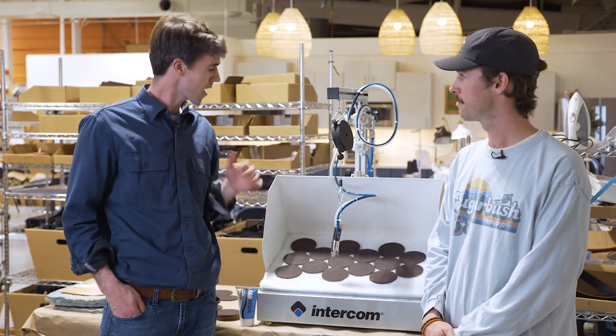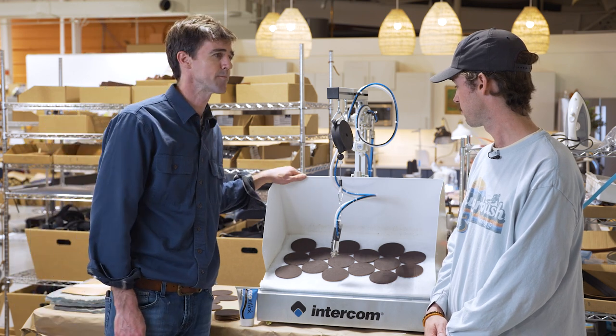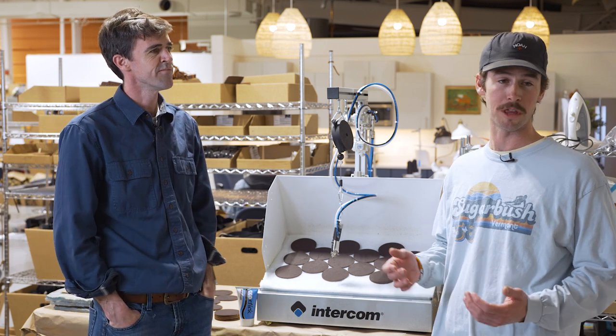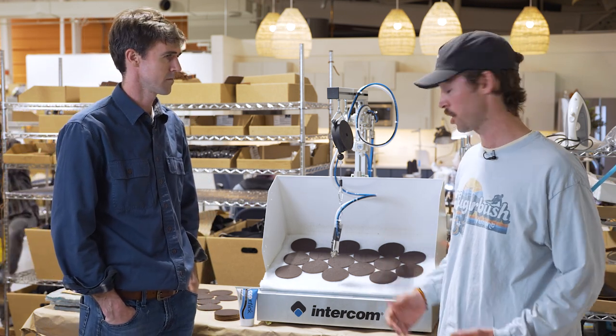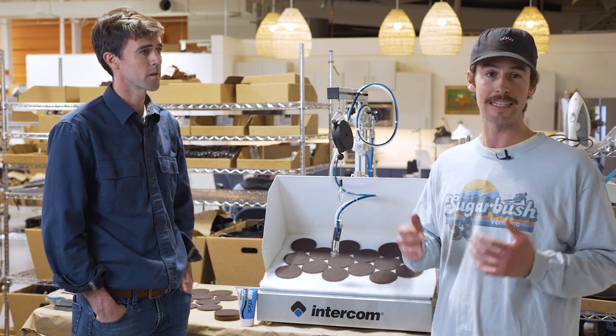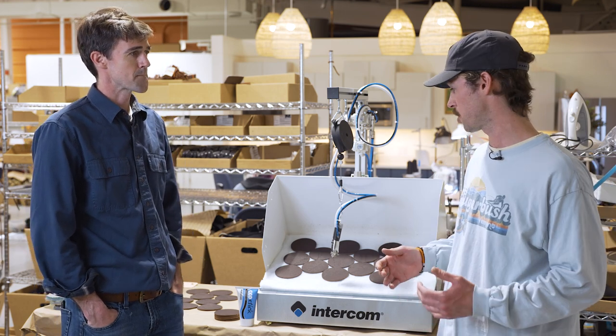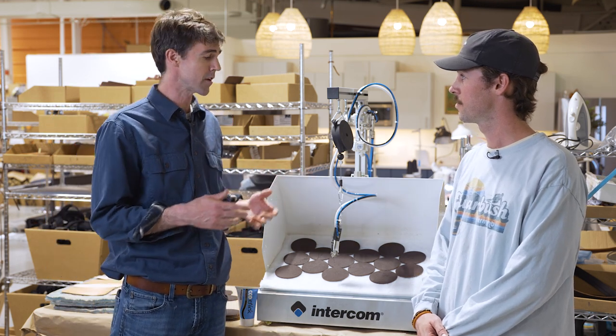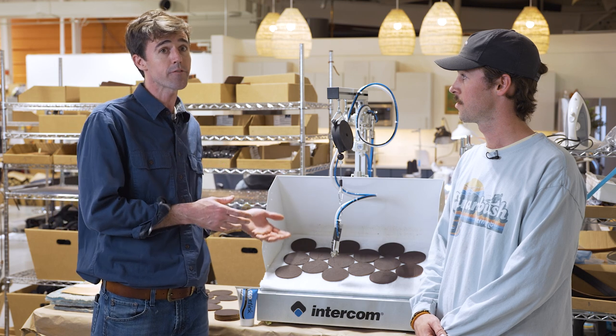We're down here with Ted, who runs our production facility for leather goods at Buckle Guy, to talk about how we use the I388 spray booth. Prior to using the spray booth, we were doing all glue application by hand with a brush. Switching over to this machine was a huge game changer — it sped up operations, is more accurate, easier for operators, and allows us to cover way more product surface area and edges. The reason we stock these machines is essentially because Ted has been using them for the past couple of years, demonstrating their efficiency for small crafters up to large production facilities.